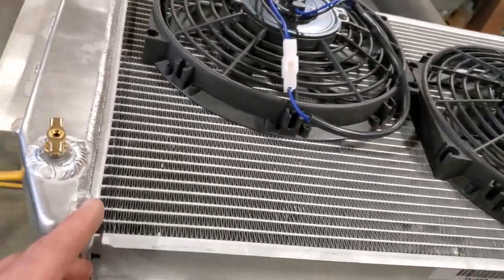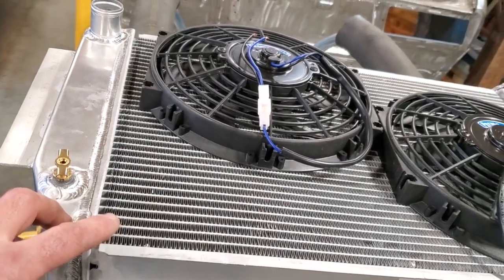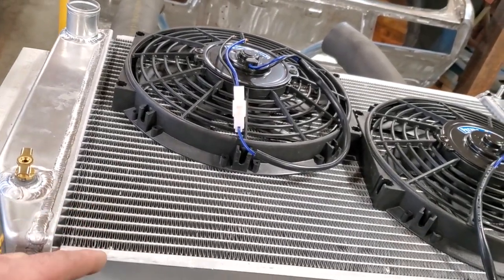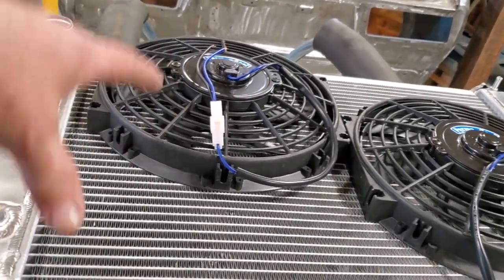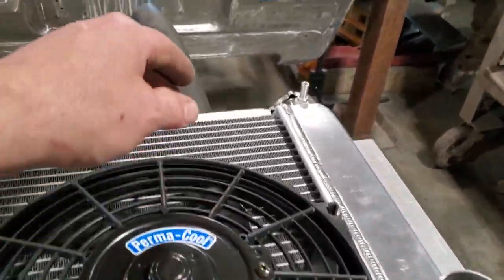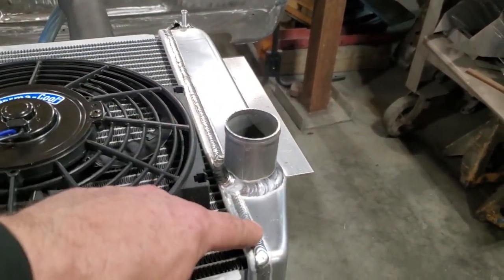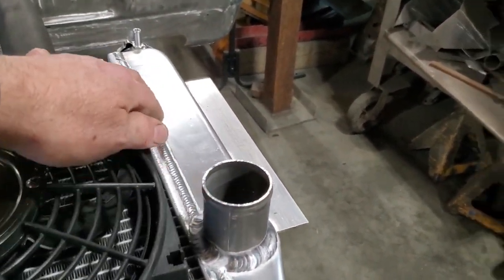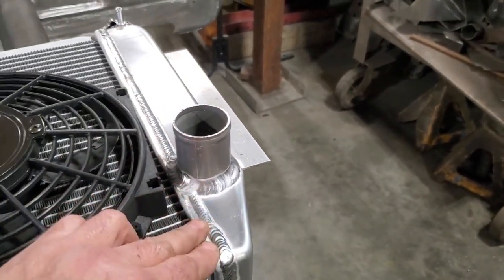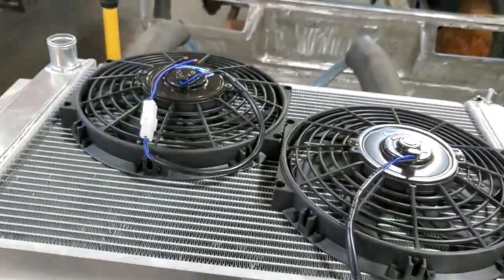So I'm going to build an aluminum box that'll come up about an inch off the body here, right? And it'll come up to here and down to this lip here, and then it'll just fit down over it and mount on these two tabs on the bottom here, and on the top you can put two little mounting clips. And it'll just sit on the side and lay against this here, and you can probably put a little rubber seal or something on it so it doesn't rub through. But I'm going to roll the edge on it so it's not a sharp edge. And then it'll just be a box with the sides bent over on it.